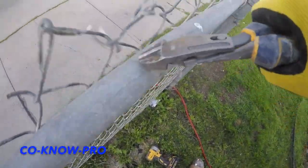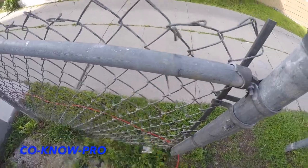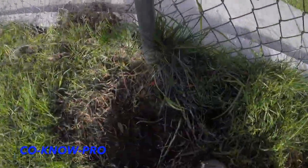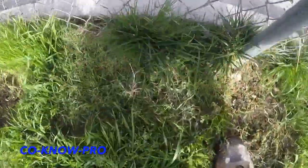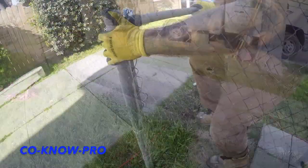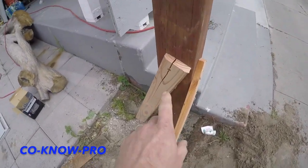We're gonna go through the old chain link fence and take some clippers to clip all the wire supports that wrap around the tube steel. Once you clip all those wire supports, there's usually one long wire that runs through the bottom of the chain link — if you cut that all along the bottom, you can remove all the chain link from the posts, roll it up into one big roll, and recycle it. Then you can start popping off the poles; sometimes taking them out of the ground is a little difficult, sometimes not.